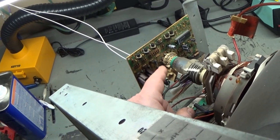If I go back to this page here, see how different this is without the red installed? If I turn my contrast back down, let's go to here. See, now I have overly green. But if I touch the blue transistor, watch the blue here. It's hard to see, but the image jumps around when I touch the blue transistor. I can tap it, and the image jumps. It's hard for you to see, but you can kind of see it jumping around. I touch the green one, nothing happens. It doesn't happen with the green. So I've got issues with green and blue. I'm sorry, the green and the red circuit. There's something happening with the green and the red circuit on this neckboard that's just not working.